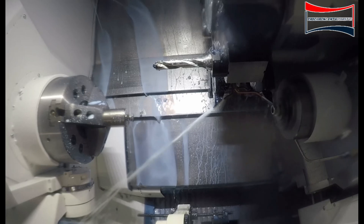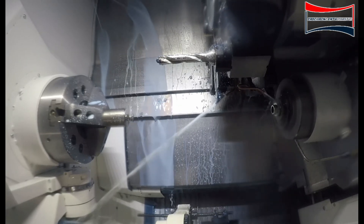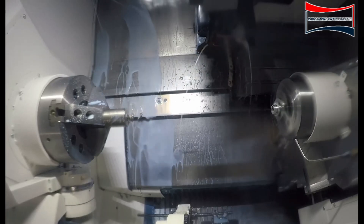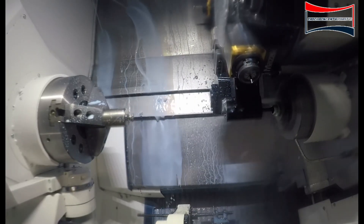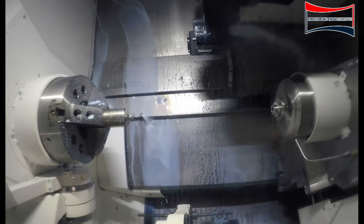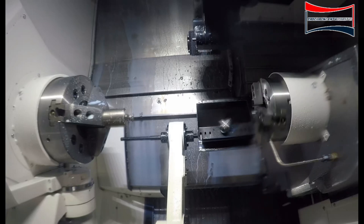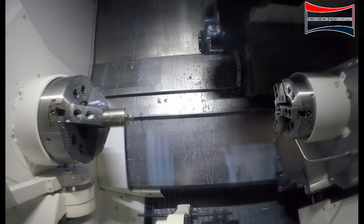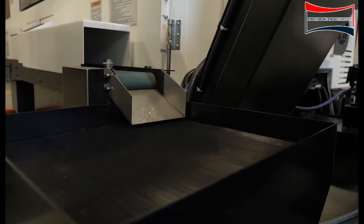Keep in mind that you do have milling capabilities on the second spindle as well, though we don't show them here. The parts catcher will come up after we finish the boring operation and catch the part into the parts bucket. The parts bucket will then unload it to the conveyor, which will exit the finished product onto the parts table.